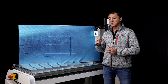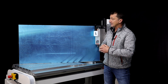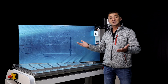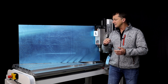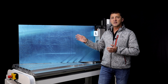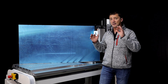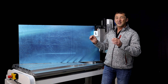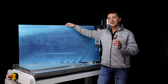Like I did in the previous video, towards the end I'll have the finished components and talk about what I've learned and what I think I can change in future concerning the tool paths — just a general overview of how it went. I'm using something like 11 tools during this operation, and a lot of them can actually be narrowed down — I could maybe get away with six. There are four different holes, but I really want to try different tooling and see how it performs in the 20 millimeter aluminum.